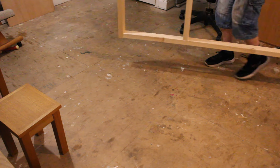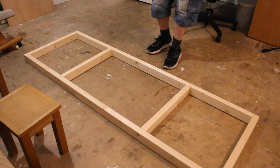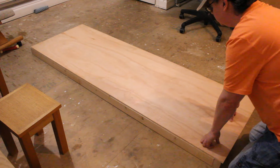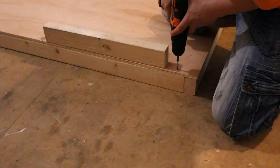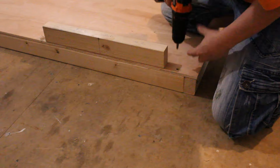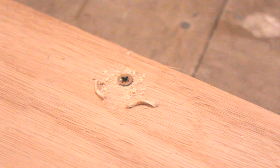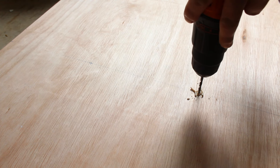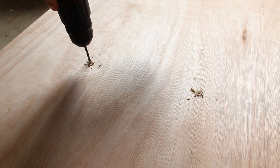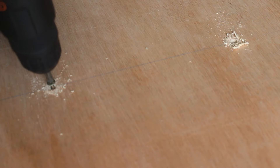The next step was to screw the worktop down onto the frame. I laid the frame down flat before placing the plywood on top, making sure everything was squared and aligned. I created pilot holes for the screws as well as countersink holes so the screws went in flat against the top surface of the workbench, then followed the same process for screwing the plywood down into the centre braces.